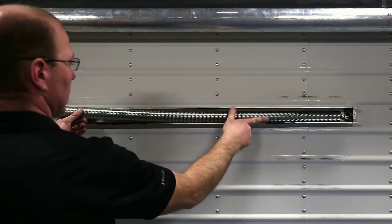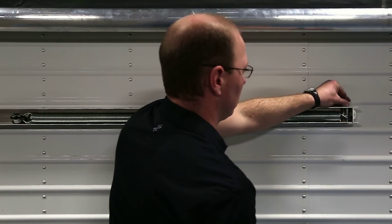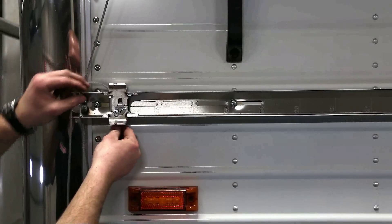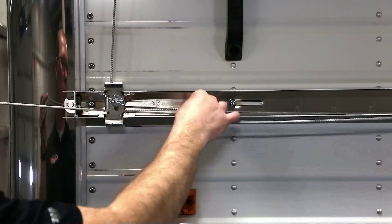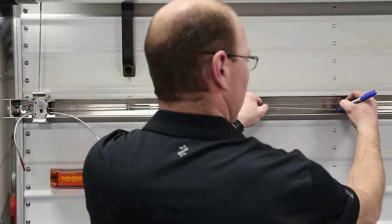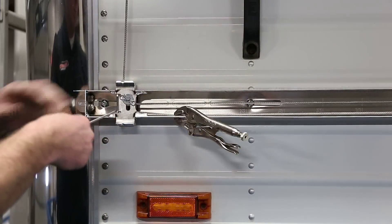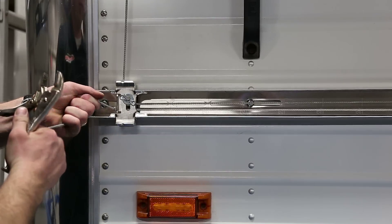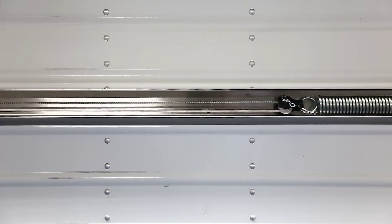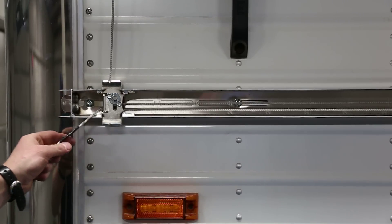Step 14. Inside the spring box, place the spring loop towards the middle of the truck box. Hold and insert a 3/8-inch by 2-3/4-inch bolt and tighten lock nut until snug. Step 15. Route the driveline around the pulley in the end of the spring box, then over and around the pulley on the end of the tension spring, and back through the lower hole in the end of the spring box. Pull the cord snug tight and make a mark on the cord in line with number 17 on the spring box. Pull on the cord until the mark is visible beyond the pulley frame. Then clamp the cord to the spring box with lock pliers and tie a square knot at the mark. Hold the cord firmly, release the lock pliers and gradually let the spring pull the cord up to the knot. Spring is properly tensioned when the pulley settles back and lines up approximately with number 15 on the spring box. Wrap tape around cord to allow about two inches of cord after cutting the excess off.